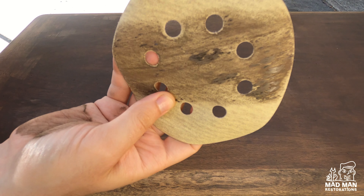To avoid being redundant, I did not record the refinishing process. In this video I just want to focus on grain filling and hand rubbing. The steps were one more coat of vinyl sealer, toner, and at least six coats of gloss lacquer. If you want to view that process you can watch my other video on Lane Acclaim restorations.